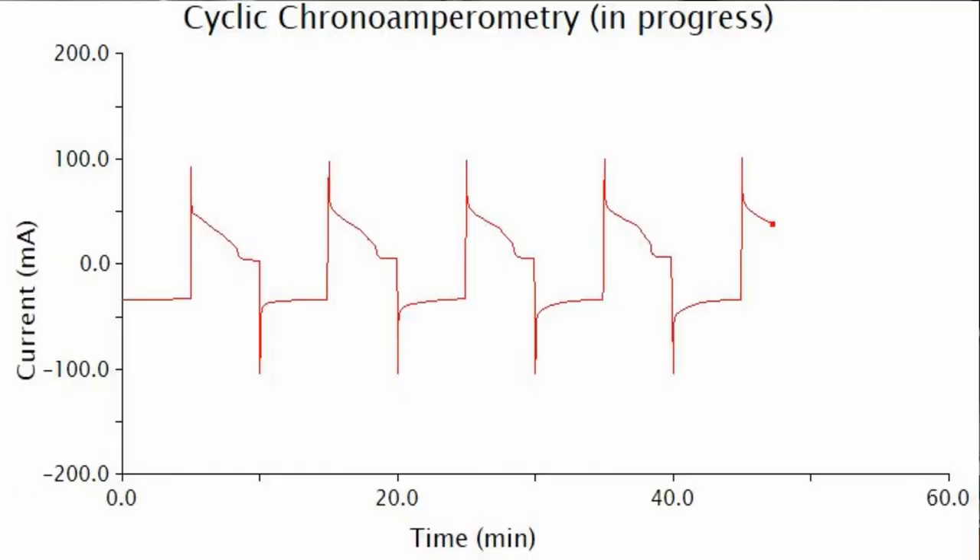The way I'd like to solve this is by replacing the inexpensive agar separator with a higher-performance separator. That comes at a cost, but we'll try to get that down if it works. I went back to the nafion separator, but kept the chemistry the same — iron with sulfate as the anode, and iron EDTA as the cathode. The question is: can we keep the EDTA from crossing the membrane and attacking the iron metal? As of yet, it looks like what was a rapid decomposition is holding steady at a fairly decent level of performance. I'll keep cycling the new nafion hybrid sulfate-EDTA cell until next week and will update you then.